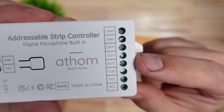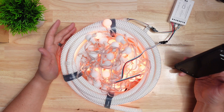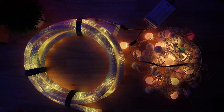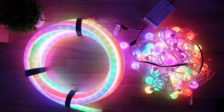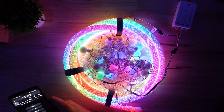Those are screw terminals and that's how you connect the LED strips. There's a button on the top which controls the relay for power to both fused outputs, and inside this thing there is a microphone. This controller runs a special sound-reactive fork of WLED so you can get sound-reactive effects that react to what the microphone picks up. However this isn't the main version of WLED, so you do not want to update this device via Home Assistant or it's going to wipe out that sound-reactive version. It's ESP32-based instead of ESP8266, so it should have a lot more memory for handling larger effects.